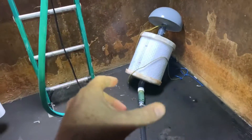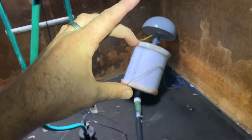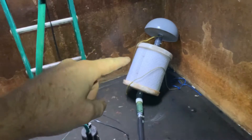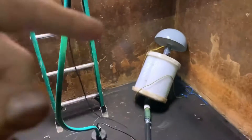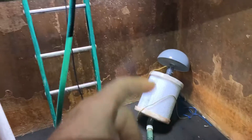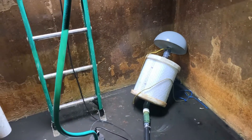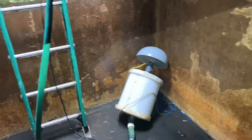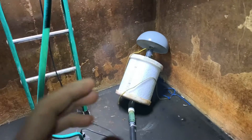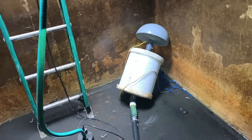This is the intake filter — the floating intake. This is the float, and this is the filter itself. You can see that yellow string down in the cistern. That needs to go up to the top and extend outside the tank so they can pull that filter out and switch it out. This is an older style filter that gets switched out every year. We also have newer style filters that you never have to switch out and don't have to pull to the surface — they're coarse enough that you don't have to clean them.